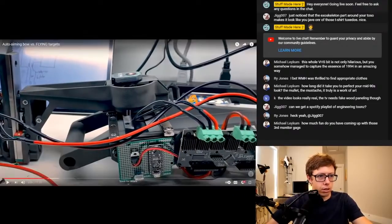The O-Drive is down here, and then this is just one of the newer Arduinos — I think it's an Arduino Metro. All I needed it to do was trigger the servo and listen to the button. This rail was probably the hardest part of this entire project. If you think about it, I have this rail which can extend out several inches, and that's trying to bend this entire assembly. This nylon arm just wants to snap in half, or at least deflect really bad. Designing the nylon arms to be strong enough was a challenge.